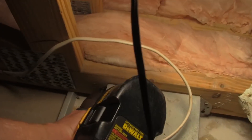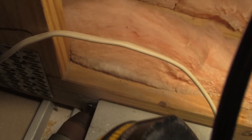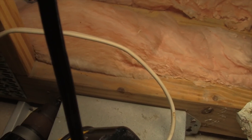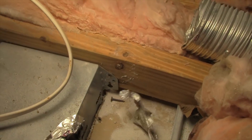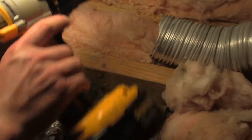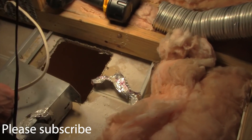The next thing you can do is grab an electric screwdriver — preferably — and look for those screws on the side of the vent box that are holding it up against the beams. You're simply gonna reverse those screws out until the vent box comes away. By the way, when you buy these new fans it'll say on the box 'no attic access required,' but the truth is you still have to get the old one out and generally the old one is gonna be screwed in.